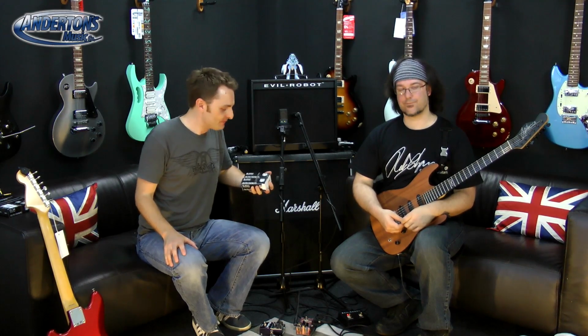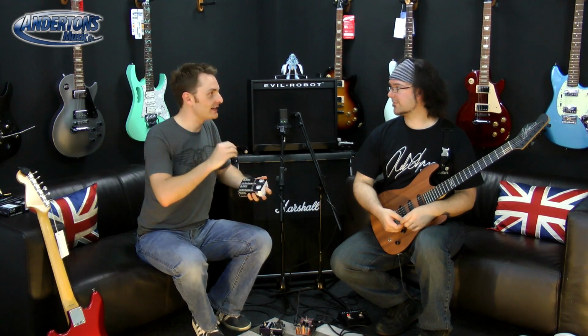Chappers and the Captain, take 5. Now we're going to try the amplifier with a pair of 6L6s. These are the types of output tube that you traditionally find in louder American amplifiers, like a Fender Twin or a Boogie Dual Rectifier. What we should hear, the difference between these and a 6V6, is more output, and that allows the amp to breathe more. You get more bass end, and it doesn't feel quite so tight. More headroom, too.